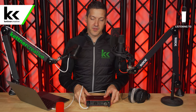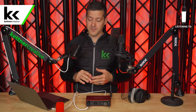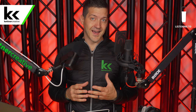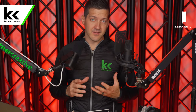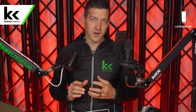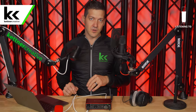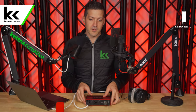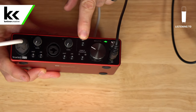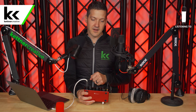Now let's talk about powering up the Blue Sona. The Blue Sona is quite unique — there is a high quality dynamic microphone inside, but there's also a mic activator that gives a ton of clean gain, essentially boosting the volume of the microphone. What you need to know is the Blue Sona will not work unless you power up that mic activator. If you connect your microphone to the Scarlett 2i2 and you're not getting any signal, you need to go back and select 48 volts of phantom power. Every time you turn on your Scarlett 2i2, this will be off by default, so you will need to click that to turn the microphone on.